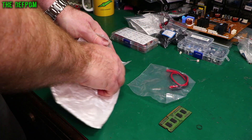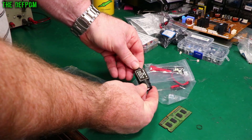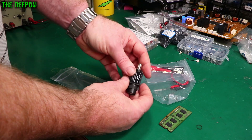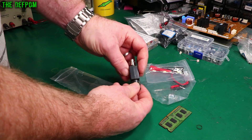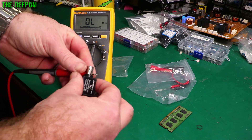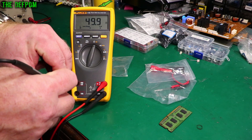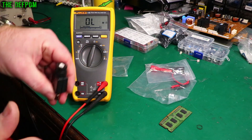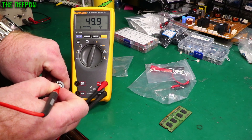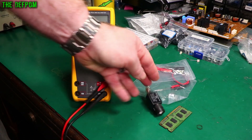And the last thing. These also took a little while to arrive — about two months. It's an inline load resistor, 50 ohm, rated at 1 watt, DC to 1 GHz. You can get older ones but they're quite expensive, or you can get these cheaper ones. I don't know how good they actually are, let's measure it. Going across the input to the center pin: 49.9 ohms. That's pretty good. Basically almost exactly 50 ohms on both sides. I was expecting maybe 51 ohms but no — bang on.